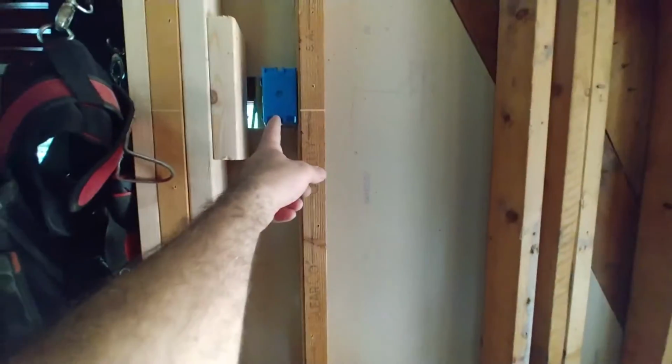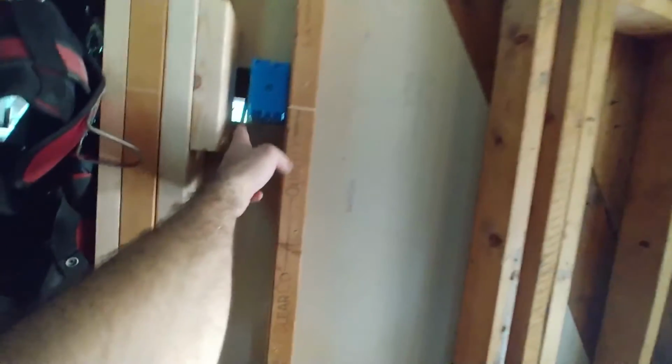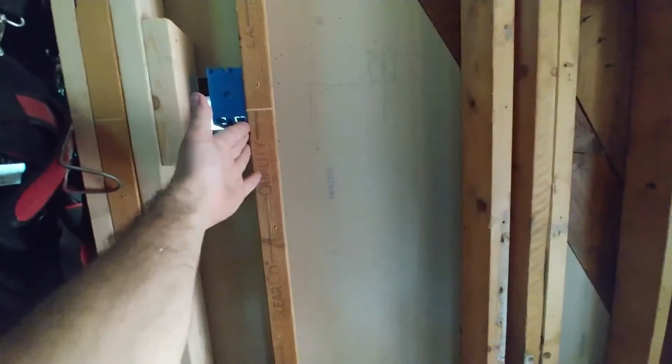And then I'm going to run into my electrical box, which I've already moved over to this side of the stud from its other location, which is why there's a hole here. I changed my mind, this being too close to the wall going that way inside the room, so I moved it over. Now I'm going to want to move it over to this side, and it'll live right underneath the panel. It'll be the hottest home run. It'll be the shortest route, boom, right to that outlet.